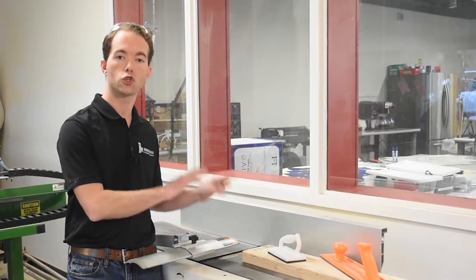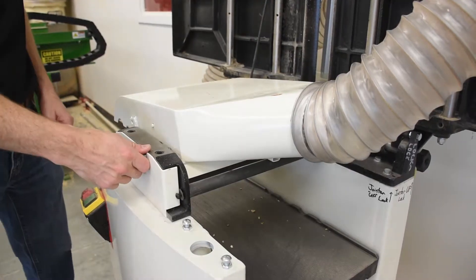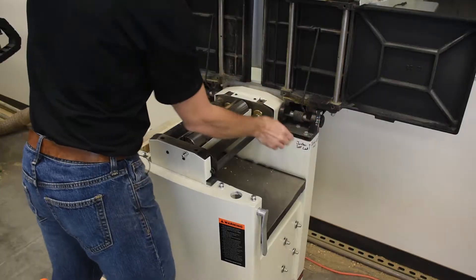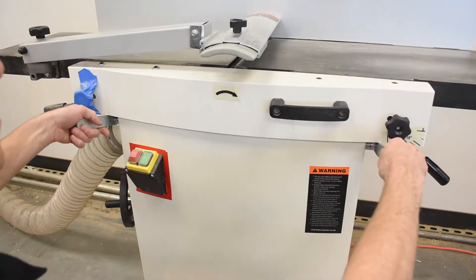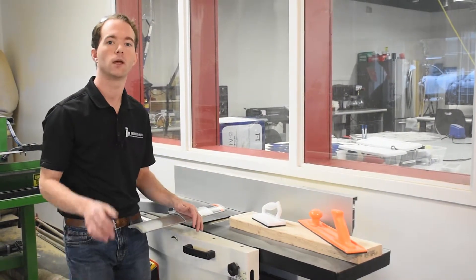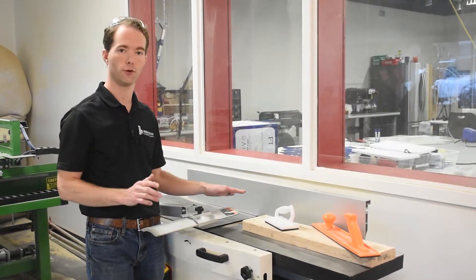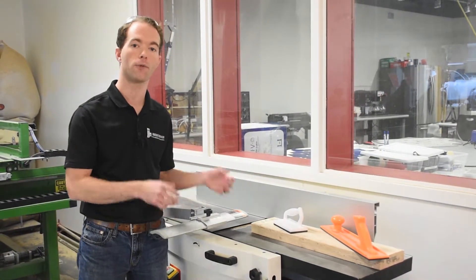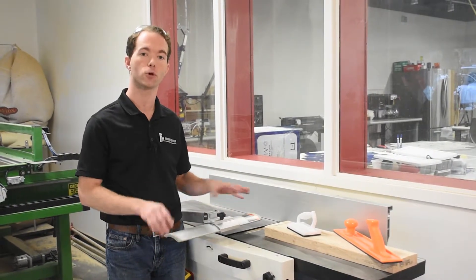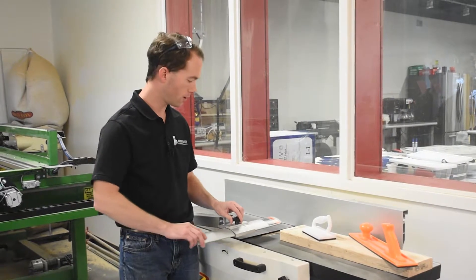You'll almost always start by using the joiner. If it's in planer mode, you'll have to make sure that the planer bed is below this arrow, and then pull the little silver pin to unlock the dust collector guard and pivot it around to the bottom of the cutter head. Then unlock the joiner here and lower it into place. Then lift up on these two little silver handles, push them into each other, and then lock them down. That keeps the bed attached to the base. It's got two parallel plates, an in-feed and an out-feed. The cutter head is right here in between the two. This tool is so dangerous because of the exposed cutter that will grab things and pull them in. This guard here can be positioned to cover every portion of the cutter head that you're not actually using. This knob here raises and lowers it, and this little knob here moves it in and out.